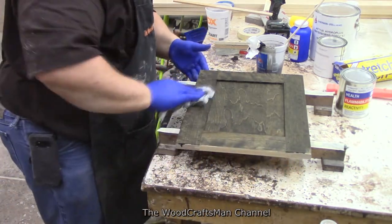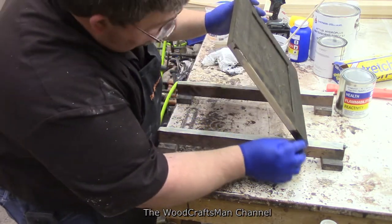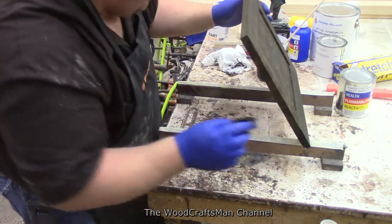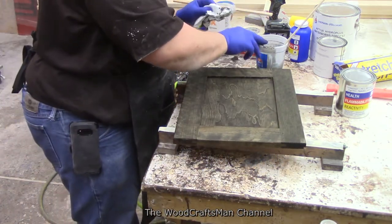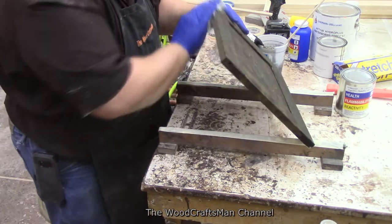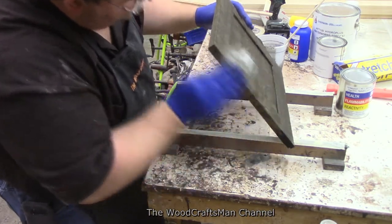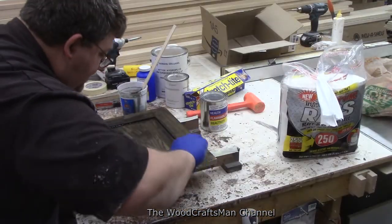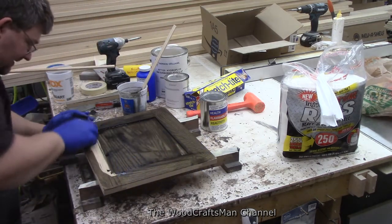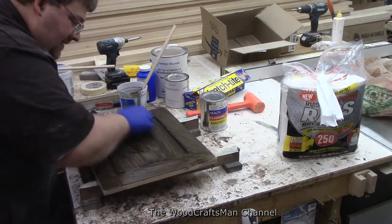It may very well be that this is more of a standard dry time, and that the medium brown I tried earlier was more of an extended dry time. If that was truly the case, I'd definitely want the extended dry time. The other thing that was very annoying about this was the fact that it did not re-wet very well at all, not to what I remember it to be. Definitely if you had a spot where the stain penetrated in the sides and you went backward to re-wet it, it did not re-wet very easily. It was almost better off if you actually took a piece of fine sandpaper and sanded it off and then went over it again.